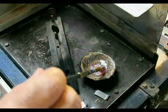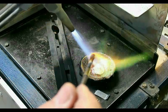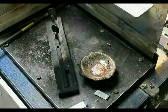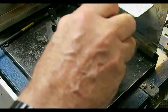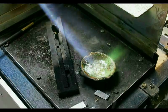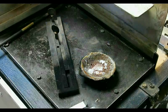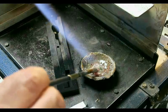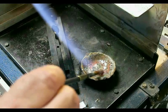I use a carbon stirring rod. Now it's cool — I put some boric acid powder on, and that stops any oxidization and cleans it up nice and shiny. Now I add the first piece of zinc. After adding it I stir again — notice there was a puff of smoke where it started burning; it was a bit hot.